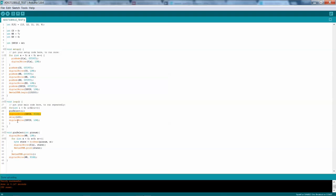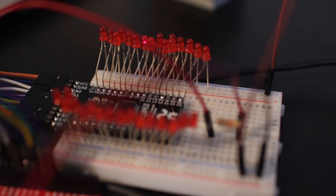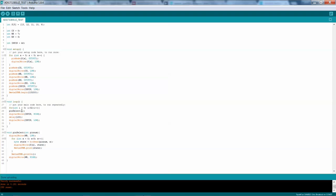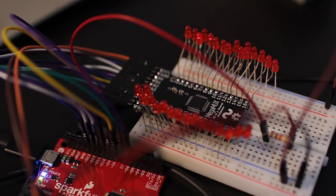So it's going to cycle through all the pins, select each one, set that pin high so the LED goes high, wait 100 milliseconds, then set it low again. If we plug it in and program it — you can see it's cycling through all the LEDs. If we open the serial monitor, you can see it's displaying the binary output based on the loop. You can run these really fast — if we change from 100 milliseconds to 10, it'll take 320 milliseconds to do all the lights, and you get a really fast light display. You can select any one at any time. How cool is that?